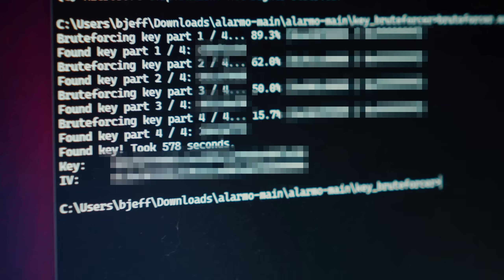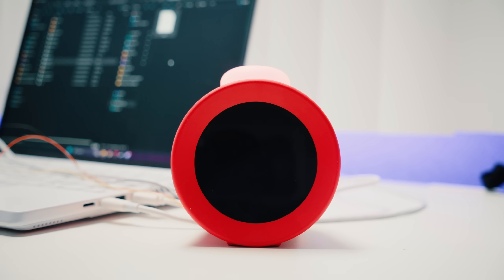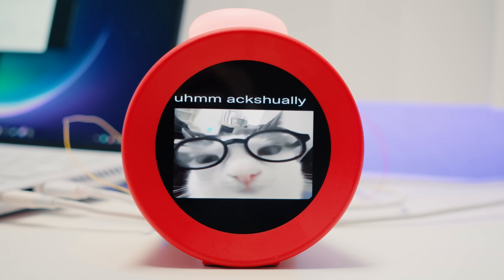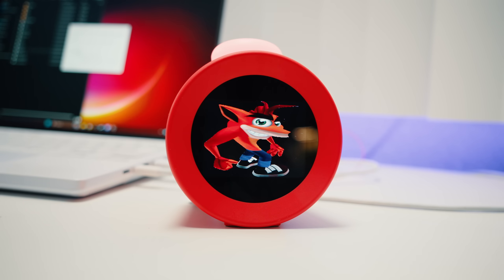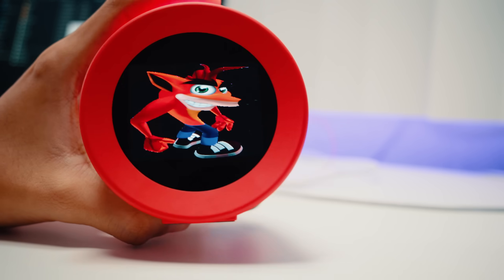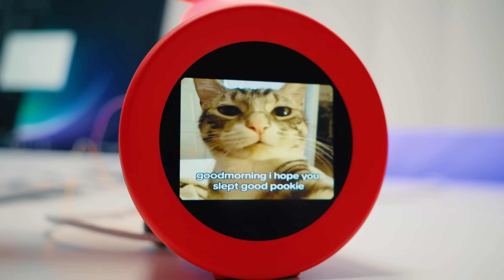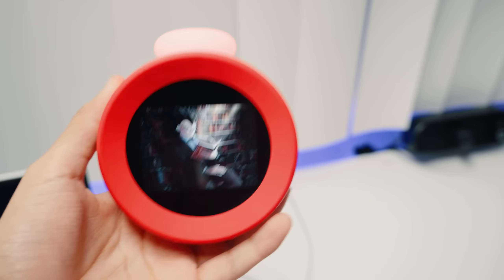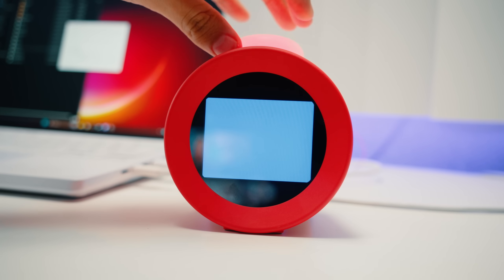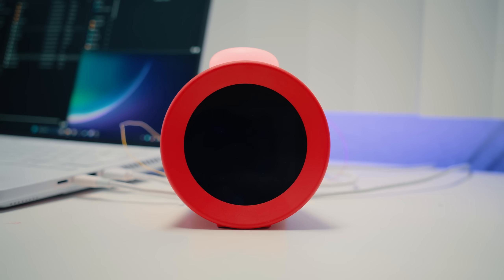Okay, so we debugged it and got the key — now what can we actually run on this thing? The first one is really simple: it's just called USB payload, and literally all it does is show a picture of a cat. But the picture can be replaced with practically anything as long as it's named cat.png or whatever. It actually doesn't scale properly, so it just squishes itself in there no matter what dimensions you have. I call this masterpiece the Clocktua. It's really just a proof of concept — made to show that yes, we can display non-Nintendo-signed content on the clock. Something funny I noticed: pressing the buttons while in this mode lets you see things like red, green, and blue for some reason. But it's still cool to see even as a proof of concept.